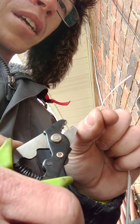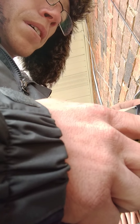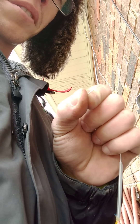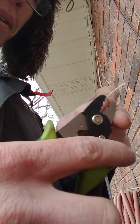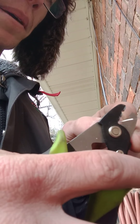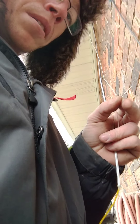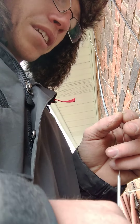So now what I'm gonna do is strip this off right here, and this one will be my second one. I'm gonna give myself about an inch and a quarter or so — that's really gonna be hard to see. That's where it gets small, or even smaller. So now I'm gonna go to the third. Whenever I'm stripping, I always bring my cutters in over here instead of over here, because just by touching it right there you can score it enough to where it'll snap off. So I'm gonna put it right there, and that's it. It seems like it's real easy on camera, but it takes quite a while to get used to doing that.